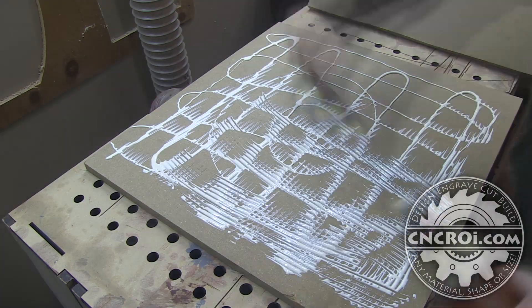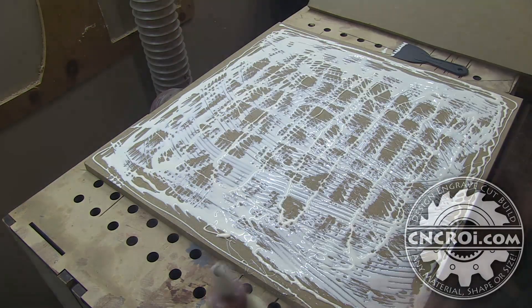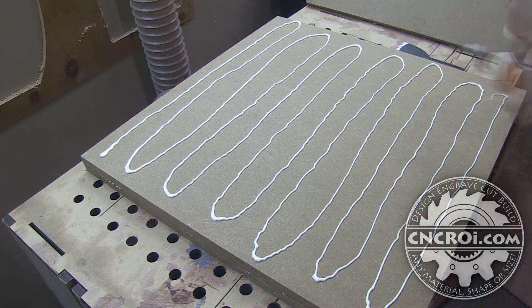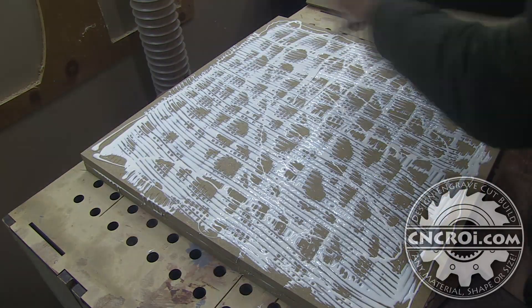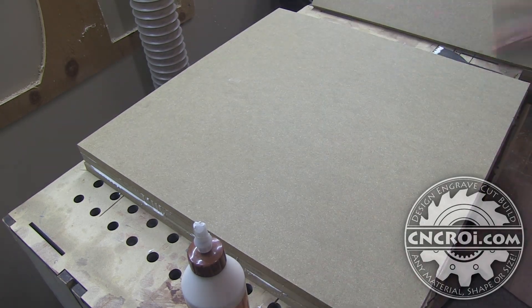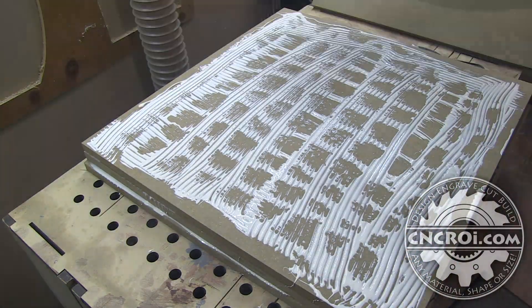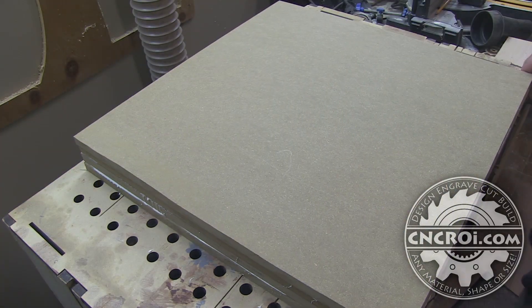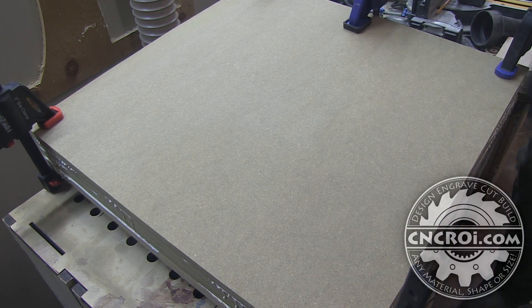This project involved making a three-inch thick MDF piece — you can't buy three-inch thick MDF, and you probably wouldn't want to because of stability issues, so the only way to accomplish that is to make it yourself. The challenge is how much glue to put. I prefer to use too much glue rather than not enough, because too much just seeps along the edges. But if I don't use enough, when the CNC is cutting through the finished model, little pieces will come flying off. You can see the strata of the different layers of MDF on the finished model — those are the layers of glue.